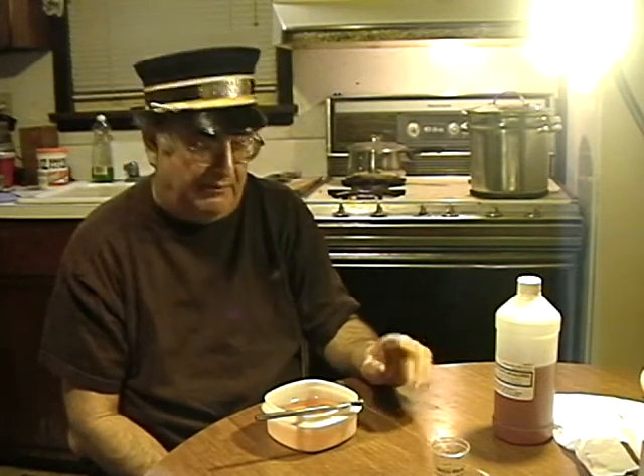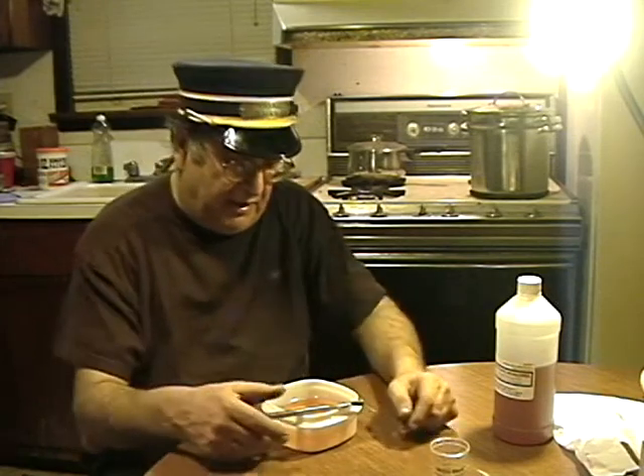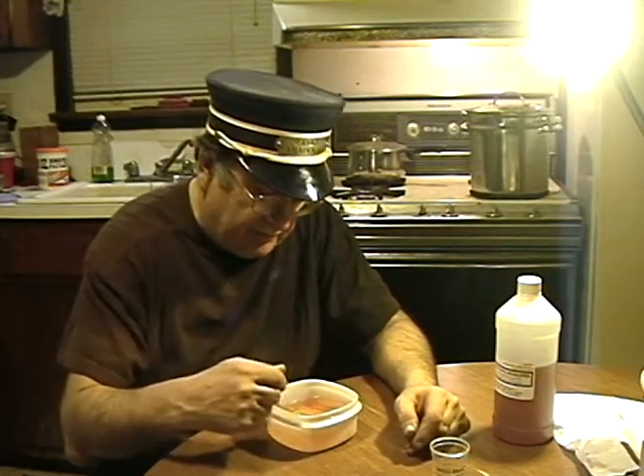Generally what I do is drill a little hole in a corner somewhere it won't be seen, then I hang it using a stainless steel wire in that plastic container with the bubbler in it. One thing about that — you don't want to leave it bubbling by itself. Keep a good eye on it because you can over-bubble. Funny story: when I first started, I put some ferric chloride in, started bubbling, went out to the store, came back and it was all over the floor. Took quite a while to clean up.